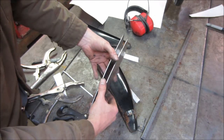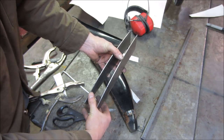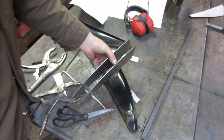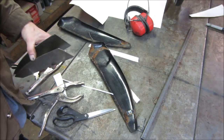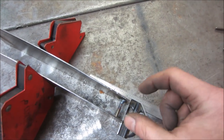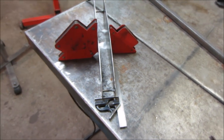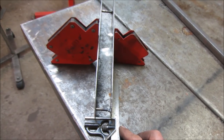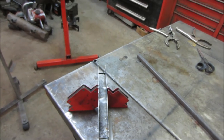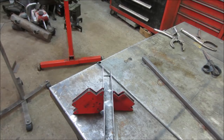We'll try to build it like that right now. And then we'll work about doing the frame on the outside. Just got to go figure out how wide that is. I ended up taking two burned up drill bits and just cutting the shanks off the width that I want. Then welded them to one side. And I just got them jigged up. They're kind of center. I can get a tack on each one of those, and then we'll stick it back in the bike and see how it does, make sure there's no interference before we start building the outside.